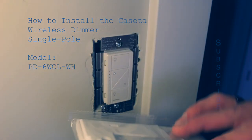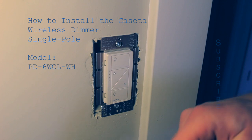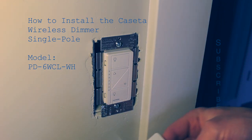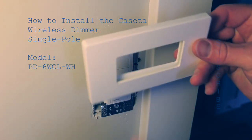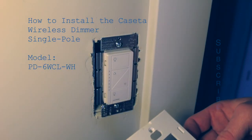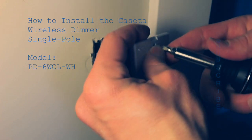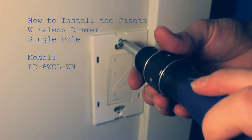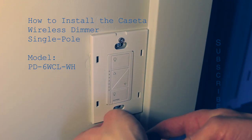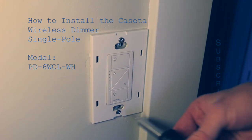I got a 10-pack of one-gang screwless wall plates from Bestin on Amazon — at the time it cost $16, so they're relatively cheap. You can also buy more expensive ones from Lutron and other manufacturers. This one comes with screws. You put the screw portion on first, then pop the front face plate over the top so it's screwless on the outside. Stick the screw in the face plate, line it up with the small holes on the dimmer plate, and screw it in. Don't overtighten — just snug enough so they won't come apart from the wall.